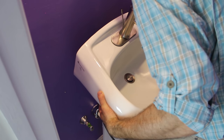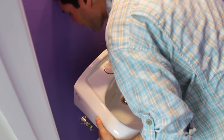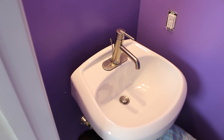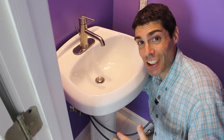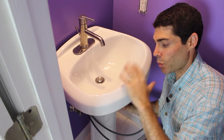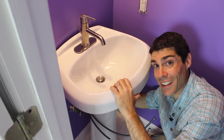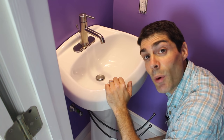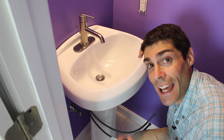With all pipes connected—the P-trap on the extension tube and P-trap attached to the gooseneck—make sure all connections are nice and tight. Grab the sink and pedestal and push the whole unit up against the wall so the sink holes line up with the holes you drilled into the wall. Then attach the sink to the wall using the lag screws.